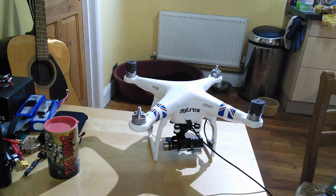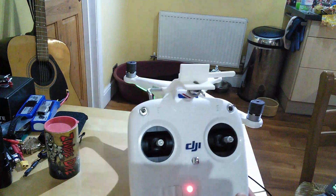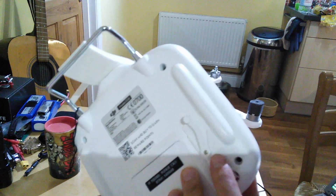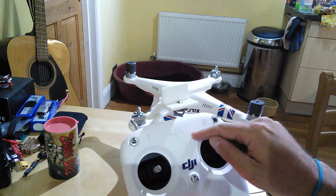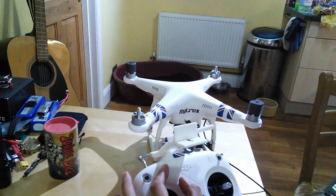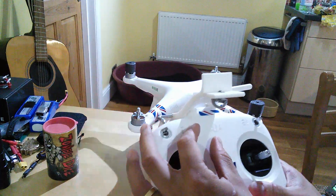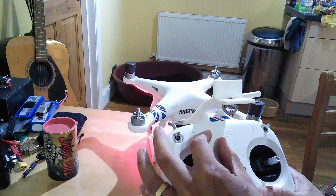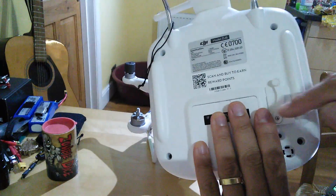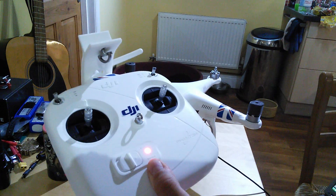Now the other option that I've seen — and I haven't done it myself — is that you can buy on eBay and other auction sites a kit where you take the back off the transmitter and where the slider potentiometer is, you reroute the wiring to a supply. They supply you with a replacement potentiometer that you mount on the top, typically on the left so you've still got your right stick control. It's a rotary knob, and with that rotary knob using thumb and forefinger you can get a much smoother transition, probably even with a higher gimbal setting, so you can do a quick flick if you want. That does involve opening the transmitter up, soldering in new connections, and drilling a hole in it — but it's another option for finer control.